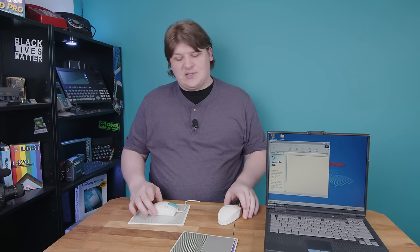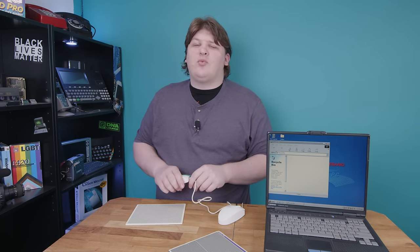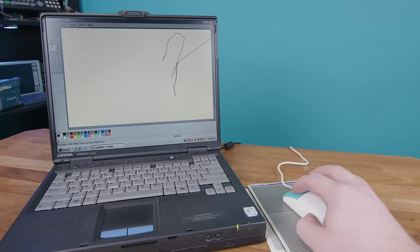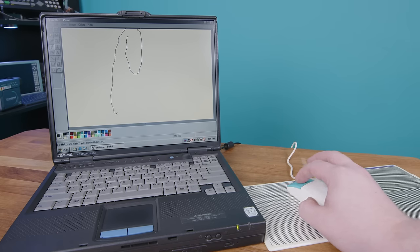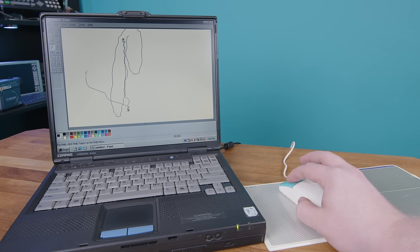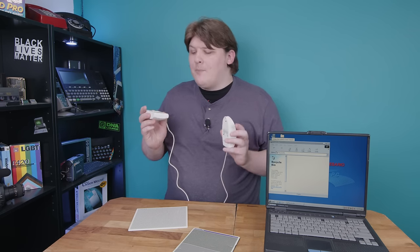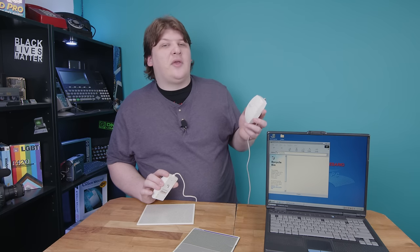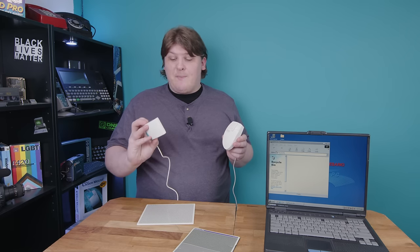There was actually a PS2 version of the LMOX, and I would love to get a hold of one so I could see if it performs a little better with a better interface. But since this is like the only one in existence as far as I can tell, I don't think that's likely. That said — and I'm utterly biased — but the LMOX feels a little smoother than the Q500. Maybe? One interesting thing I discovered while testing these: I tried swapping their pads to see if anything fun would happen. They didn't work at all, I just got total gibberish — the mouse bounces around all over the place. But when I put the mice back on their correct pads, it took a few seconds for them to figure out how to mouse again — they just did weird stuff, and then slowly calmed down and started behaving normally. That means my interpretation of how these work is completely wrong. They're not digital at all — they must be doing some sort of analog sampling or something. This seems like a very sophisticated piece of electronics, and I can't even imagine what this one's doing.